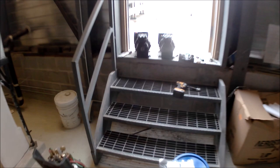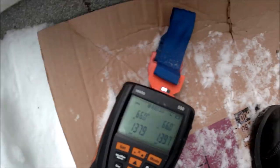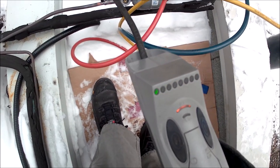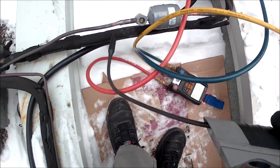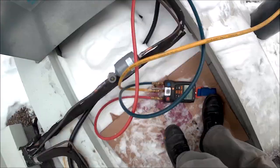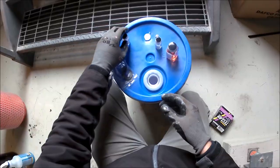Got the compressor out - a little semi-hermetic compressor. Now we're doing our nitrogen test and a quick electronic leak test. I'll leave the nitrogen in for at least 30 minutes, maybe longer - I'm going to take my time with this one. Hit the fast forward here, check all the joints, no leaks found. We are ready for our vacuum and recharge.